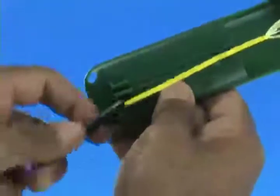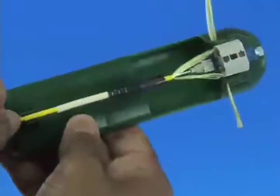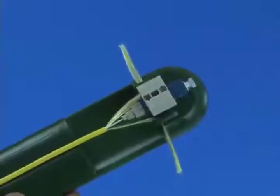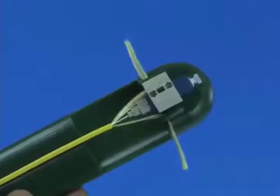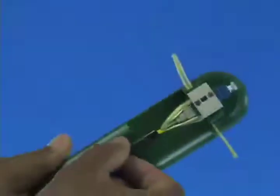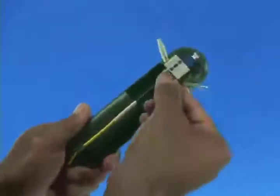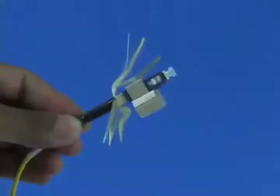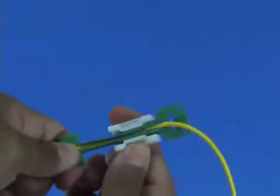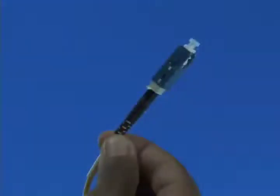Remove the cable from the assembly tool cable grip. Slide the boot up the cable toward the connector and past the assembly tool cable grip. Straighten out the cable and return it to the cable grip. Divide the Kevlar strands into two equal bundles. Place the Kevlar bundles into the assembly tool Kevlar grips on each side of the connector. Tug the Kevlar lightly to ensure it's pulled taut and the 900 micron buffered fiber is not bent. Screw the boot onto the back of the connector to fix the Kevlar. Remove the connector from the assembly tool, remove the wedge clip unit, and trim the excess Kevlar strands using Kevlar scissors. Release and remove the cable clamp. Termination is complete.